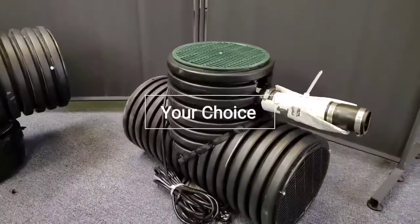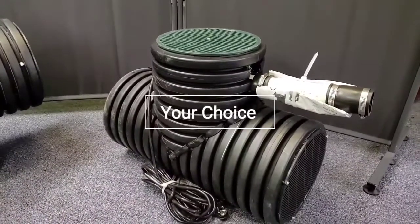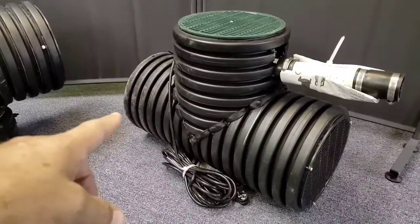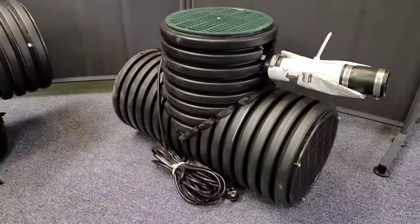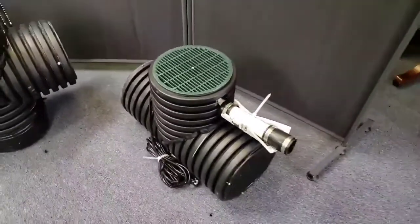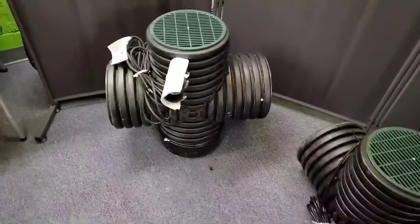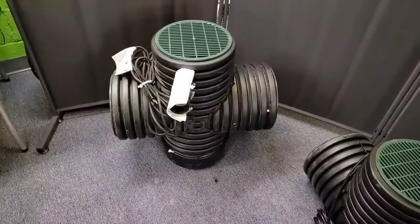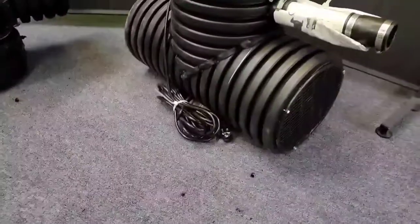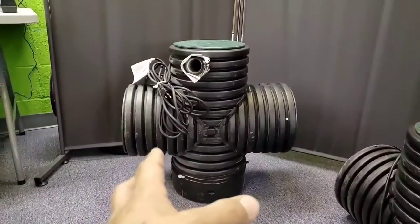So the Badseed micro — we could not fit a half-horsepower pump in this. So the micro on the Badseed is a one-third horsepower. But it's 24 inches with an 18-inch dig, simply the easiest thing to install. So if your water problem isn't so severe that you need to pump 160 gallons per minute — Screamin' Demon territory — then the Badseed might work for you. It's super easy to install, and from an economic standpoint, it doesn't have the cost of the half-horsepower plant.